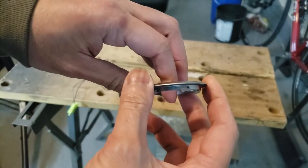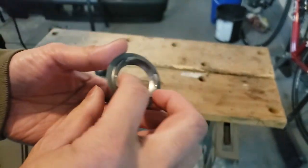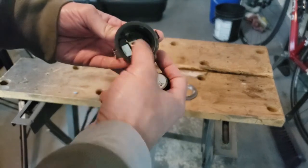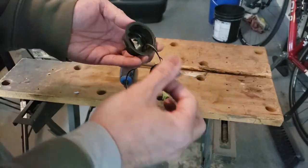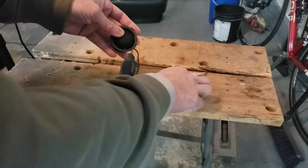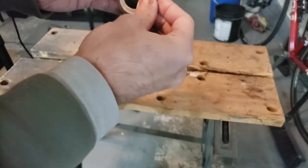It's relatively strong. I'm not going to tug on it and try to break it, but it feels just as strong as it was before. Some of the aluminum foil tape is still on there, but it's going to look like this anyway so you're not going to see that back part. Now we're going to test it on this bracket. I'm going to fully assemble this tweeter. I put this clip inside the tweeter housing here just because it's a little bit spring loaded, so that plastic cover has to be able to withstand the spring — that's the tension that it pushes out on the tweeter. Otherwise, if it just breaks, then we're no better off than just taping it on. The epoxy has been curing for a while now, it's fully hardened — you can really feel it's stiff. I didn't cut a lot of it off just so that it has enough on there to maintain its strength.